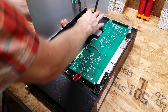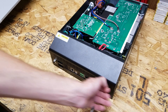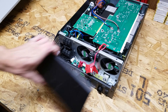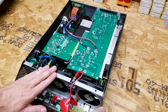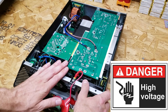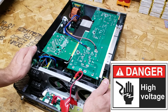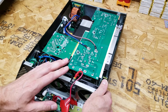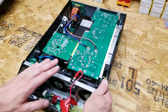I see there are a couple of ribbon cables. One thing you want to be careful with whenever you open something like this up is that some of these inverters have extremely high power capacitors in there — that would be a huge electrocution hazard, it could be fatal. So definitely make sure your inverter's been off for a while and the capacitors are all fully discharged. Don't go sticking your fingers around in here.